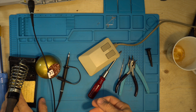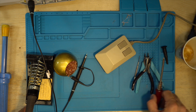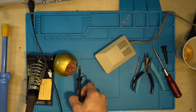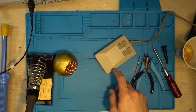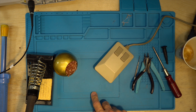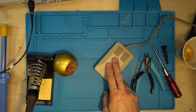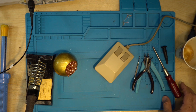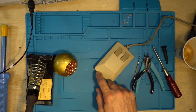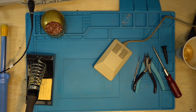So let's see what we did: we changed the resistors for the pull-down on the phototransistors to get higher voltages, and it now works great inside the Amiga. So if you have this old mouse you can use this technique to revive it maybe. I'm pretty pleased with it - it works, doesn't cost too much. I think it's really nice.